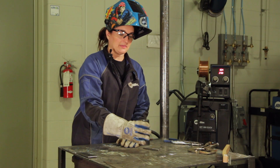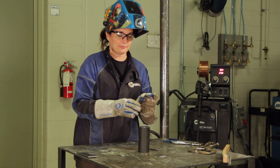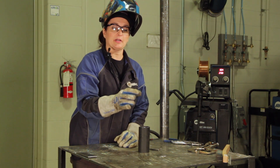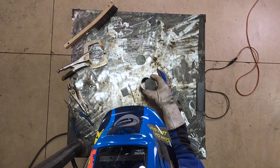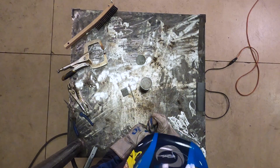First off, I'm going to take this piece of pipe and fit it up with an end cap, which was previously a plasma cutout. You can cut it with a plasma torch or you can cut it with an oxyfuel torch, whichever you have available. And we're just going to fit it on the end. And now we tack it together.